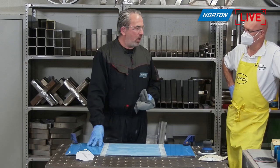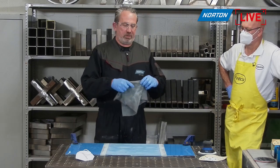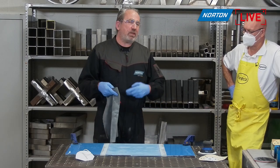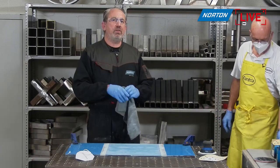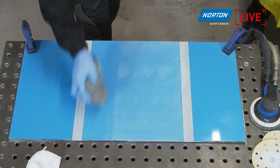This panel, I think, Mark, is about 2.5 years old. So it's a pretty old panel, to be honest with you. Because of COVID, it's been difficult to get supply of components like this, so we've been left with an old one. But it's still possible to do. You just have to incorporate that extra sanding step because it's difficult to leap from 400 to 800 in one big gap. That's why we do the three-step sanding process on this.